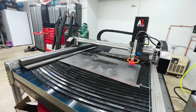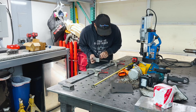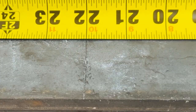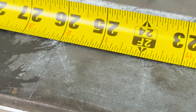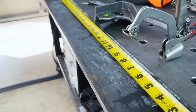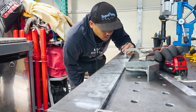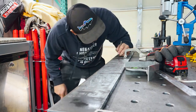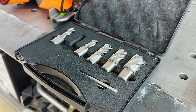I grabbed some flat bar — I want to say it's four inches wide by three-eighths — and I'm going to be marking out all the different holes, spaced about four inches on center. These holes are where I'll use shackles to connect my two lifting magnets. I probably could have cut these holes on the plasma table, but with plasma cutting, holes under half an inch tend to be beveled, so I wanted nice clean through-holes for the shackle pin.